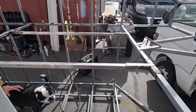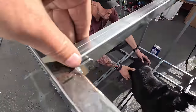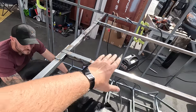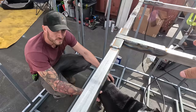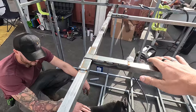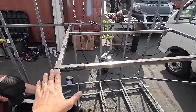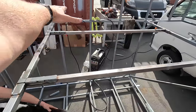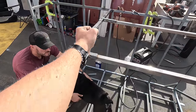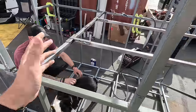So this is the final idea for the bed flushed out. So we've got our brackets here that are mounted. This piece is removable. Both of these pieces are removable. And then these just slot down into here so they don't slide out when I hop into bed. But essentially this is the floating bed platform. It should be enough to hold me up, especially with the wooden slats going across. But worst case, if I ever need to, I could just pop a little center support right under this right here and be good to go.